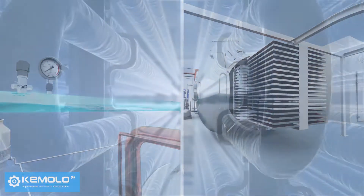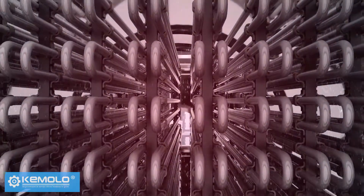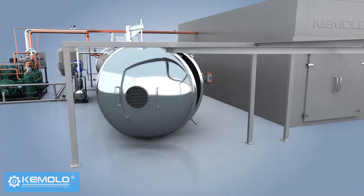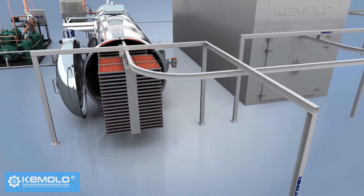At this time, it is necessary to lower the temperature of the shelf and release the vacuum for discharging. After discharging, the frost on the water vapor collector needs to be defrosted for the next batch of production. Therefore, freeze drying must be produced in batches and the interval between each batch is about 1-2 hours.